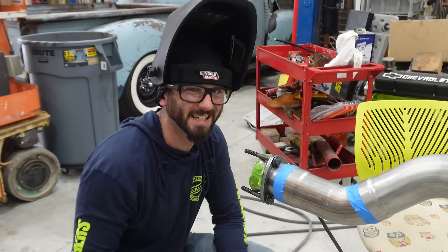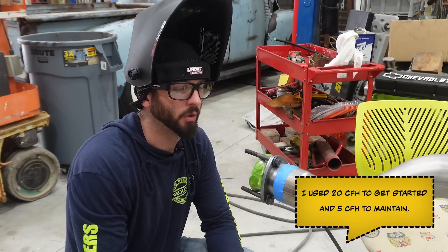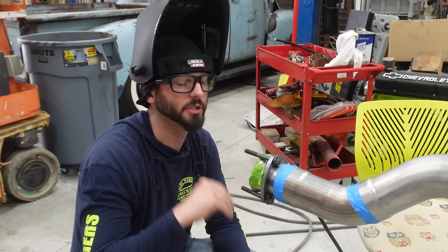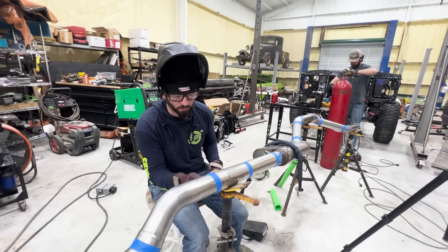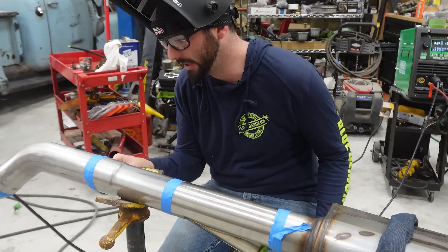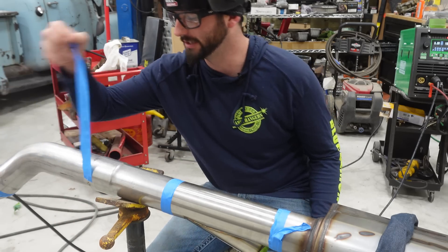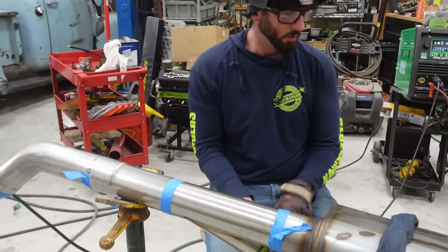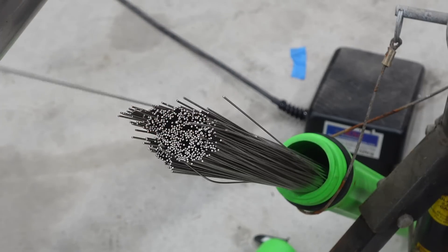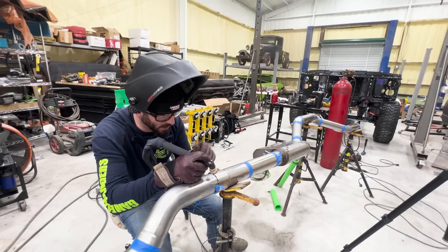There is a formula for purge time based on diameter and length of what you're trying to purge. To feel whether you're actually pushing oxygen out, get your hand licked and put it near the vent — you should feel a little bit of cool argon coming out. All right, I think we've waited long enough, so let's open up some of these fits. We've got little surprises in each one. I'm a pipe welder and fitter by trade — I haven't totally got the hang of this exhaust stuff. We're going to use 308 filler wire, 0.045 size, and dive into these welds.